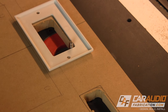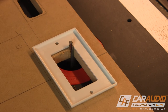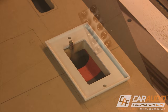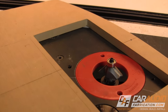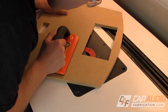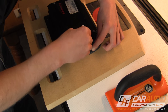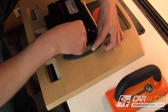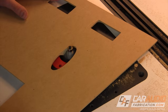I have some banana plug binding posts that I'm installing, so I'll be using the wall plate cover that came with those to make a perfect fitting hole. I check everything for fitment before proceeding. To give the panel more visual appeal, I use a chamfer bit on all of the holes and the outside edge to give it a finished look. I also add a nice oval hole for the wire to come through for the amplifier, then chamfer that as well.